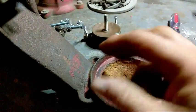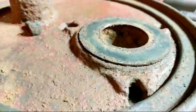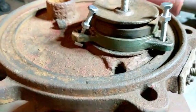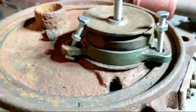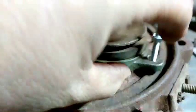And then when that valve shuts, it shoots water up into the inside valve, which I've taken apart. The inside valve consists of this casting, another gasket. There are 6 gaskets in a Rife ram, and that's pretty consistent that I've seen. I've taken several of these apart. So that's the inside valve. It kind of acts like a check valve.